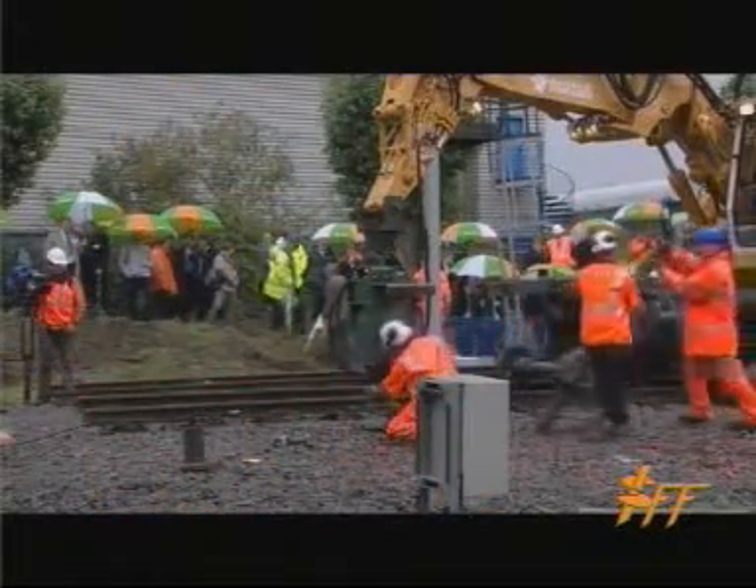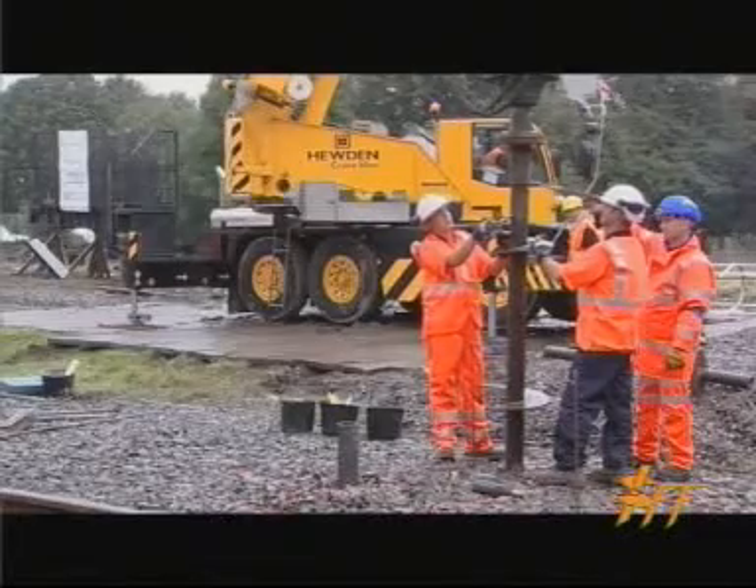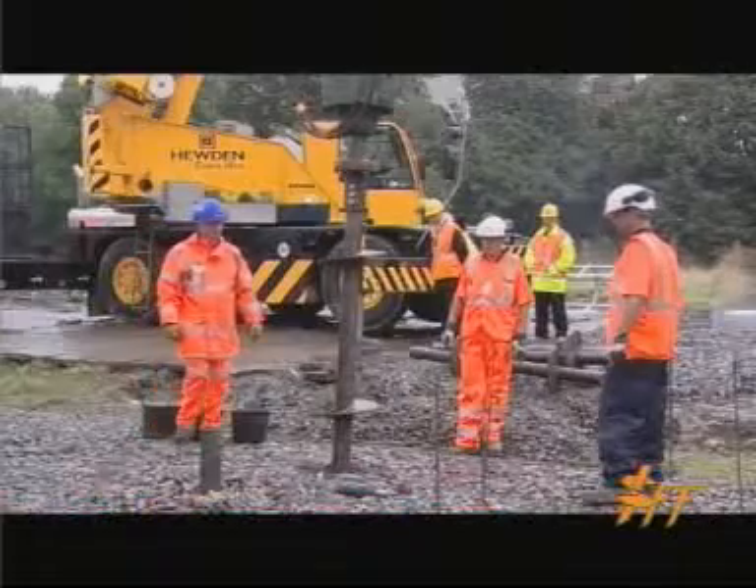The piles are in two meter lengths. They're not too heavy to lift. Men can reach up to screw in bolts and you will see that one connect. And you'll see how quickly that's going into the ground.